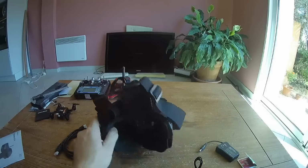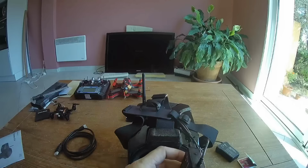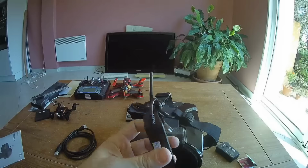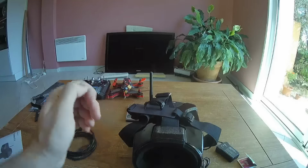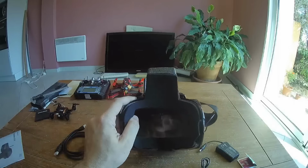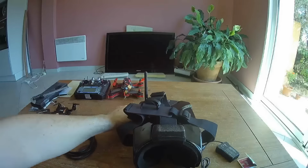of usage. Be aware, you don't have any battery or voltage alarms, so as soon as you fall below 6.9 volts, your screen will cut immediately. So be aware, with this machine you should have a battery, okay, but no balancer plug to connect one. So it's a real drawback. There is absolutely no low voltage alarm in these goggles. Even if I will show in a few moments, in terms of OSD you have the current voltage displayed, but as you will see, it's so narrow that it's not obvious to see it.